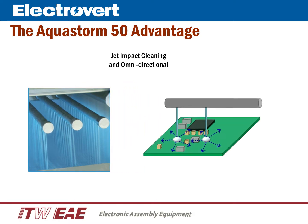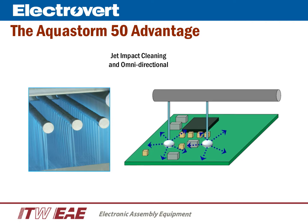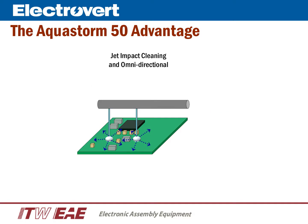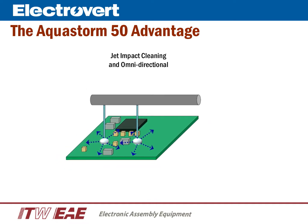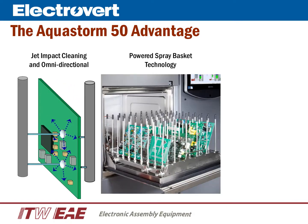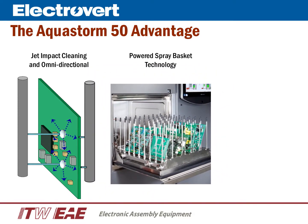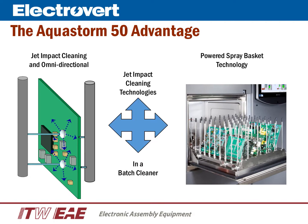If we take a closer look at what makes the JIC spray so effective: as each JIC spray hits the board assembly, an omnidirectional spray pattern takes place — meaning that the spray pattern disperses in all directions. To get JIC technology integrated into a batch, we took the JIC spray bars from an in-line cleaner, turned them vertically, and integrated the spray bars into our power spray basket technology. The power spray basket has multiple spray bars with JIC nozzles that expose both sides of the board assembly to direct impingement JIC spray.